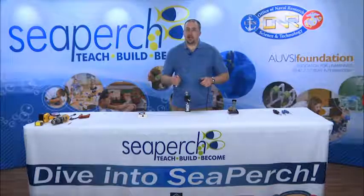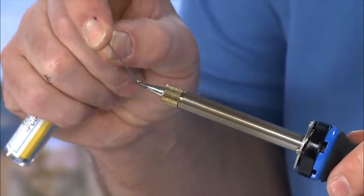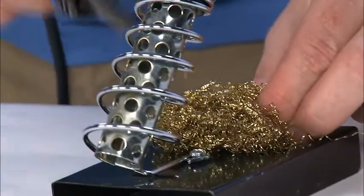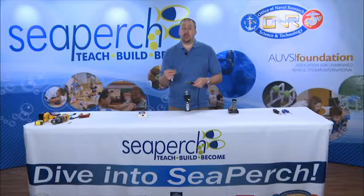While we're using our soldering irons, we'll always want to make sure that the tip on our iron is clean. To do that, we'll melt solder onto the tip and then wipe it off using either the sponge or the brass wool, whichever you have. By doing this, we ensure that we always have a nice, hot, shiny tip to our soldering iron, which will make the soldering go much easier.